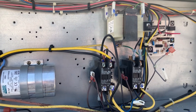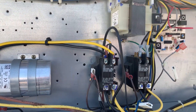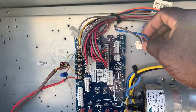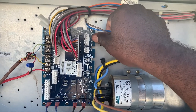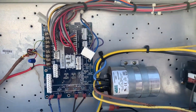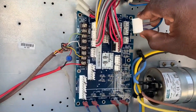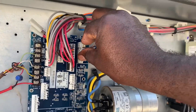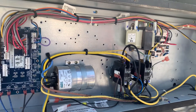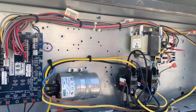It popped right away, so this tells me my issue is not coming from my contactor. When I remove this harness that controls the compressor contactor on the terminal board, it doesn't trip. But if I reattach this and turn on my disconnect, it trips right away.